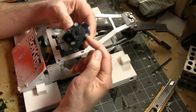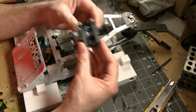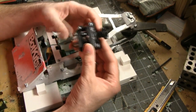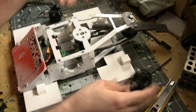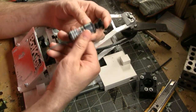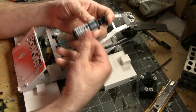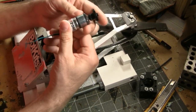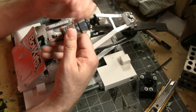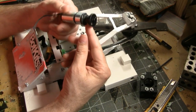What I need to do is redesign these motor mounts to not solely rely on the clamps. There's a four-bolt pattern on the front of the gearbox that I'm going to design around and build into the piece. I'm also thinking forward to where I'll be moving to a brushless drive system. Delta is still going to be brushed with the same motors, but if I go to an OutRunner brushless drive motor, the outside of the motor spins around — like how the weapon motor works — so I can only rely on the gearbox for attaching the motor. So the motor mount can only be built to secure to the gearbox. I'm designing a quote brushless-ready drive motor mount.